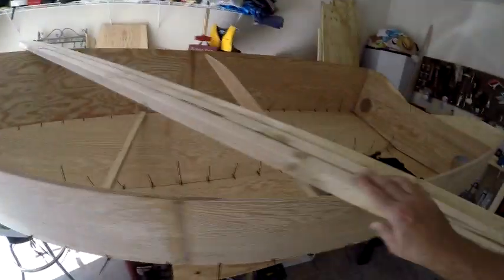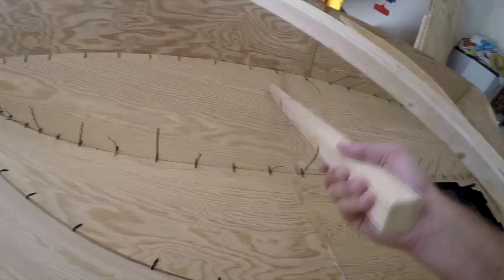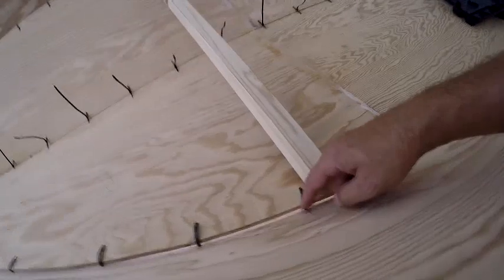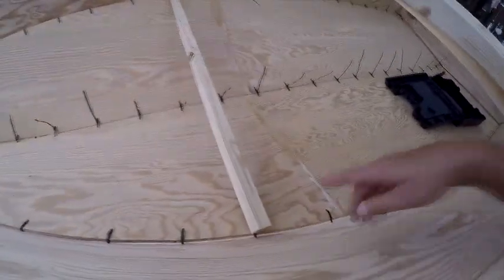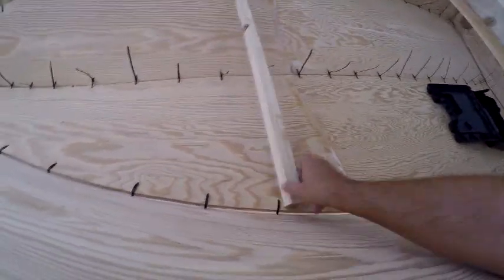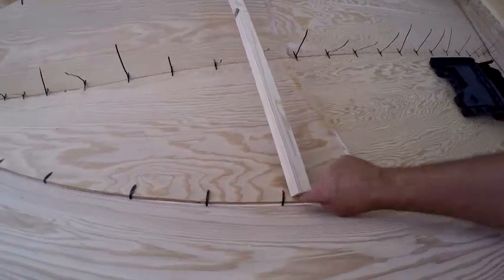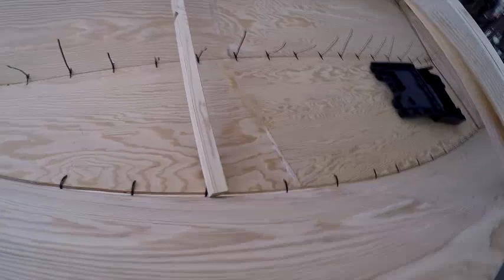What I figured out this morning: I'm going to take these two-by-twos — here's a short one as an example — and lay them up against this hole right here. Then I'll cut the ties, raise the side up to the proper level, run a screw through that hole right into the side of this, and it will sit right there and hold the side up in place. That's the plan.